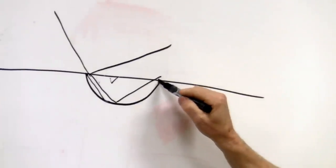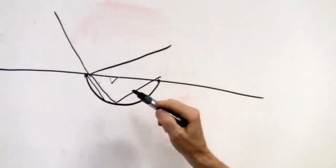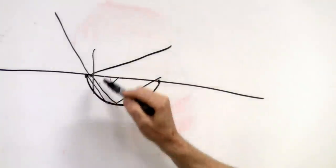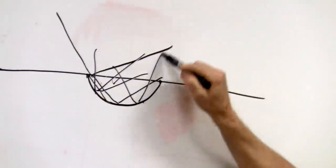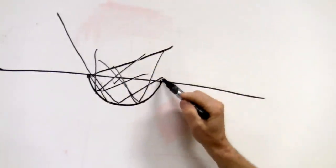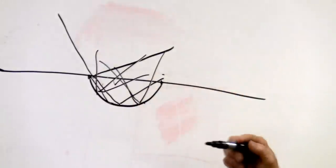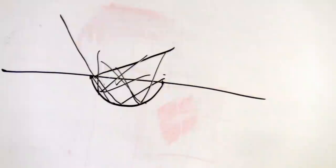And as long as you worked off of these two points here, then the way the plane is designed, that cutter would come in here any way that you put it, as long as you work between these two points, which is going to be your goal for making a radius.